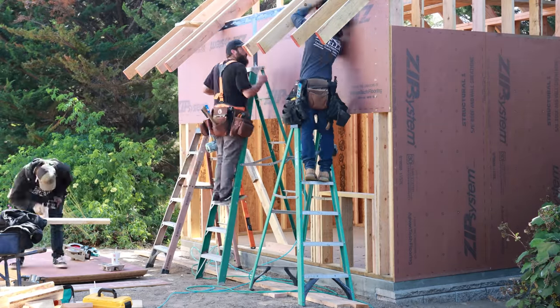Today we covered a couple things, and I'm glad we got to cover them. We got to cover rake wall building. We got to cover two different methods of doing it, such as using a laser from the ground, shooting up, marking up top, measuring with a tape measure. And then we did the same method, but with the calculator, showing you how to do it that way. And if you didn't get what we were talking about during that whole process, I do have the whole entire layout of how we calculated our run, rise, pitch, all that in the description down below.